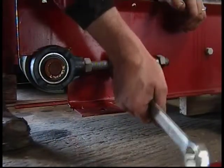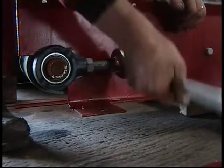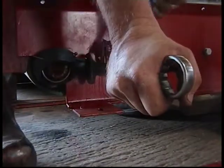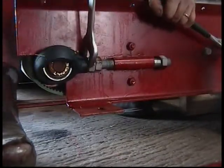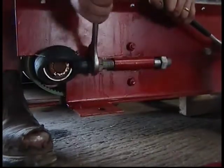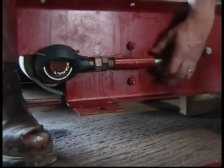Removal of discharge conveyor belt. It is recommended side skirt replacement occurs on renewal of belt. Remove the adjuster screws from the SCH25 adjustable bearing. This is easily achieved by locking the 2 nuts together as shown. They then hold on the threaded bar, allowing removal. Complete this task on both sides of the conveyor.